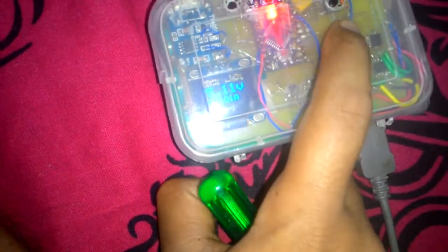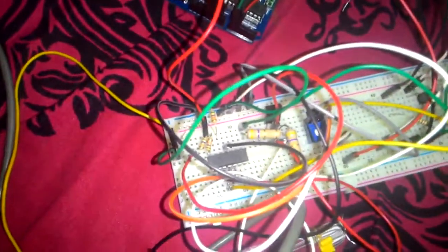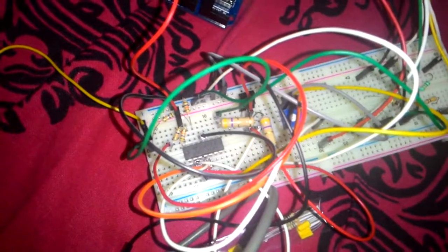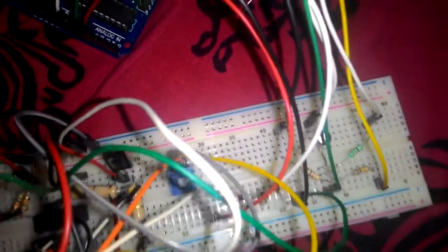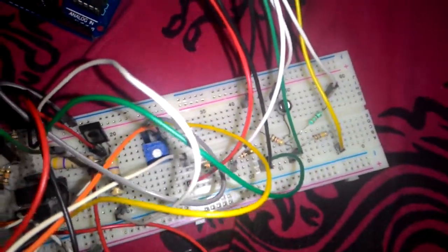We built this using one of the V2I converters, which is an op-amp and a medium power transistor like the BD139, plus a resistor. Here is our trim pot with which I can vary the voltage, and V divided by R gives me the current. I used a 5 ohm 3 watt resistor in this configuration.